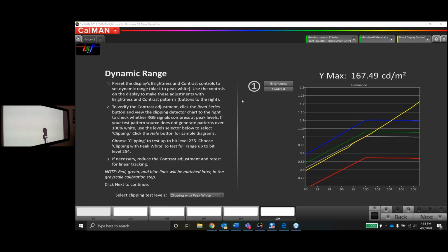And it goes the other way too. The bigger the screen, it doesn't have to be as bright to be as impactful, if that makes any sense. If we did 50 foot Lamberts on a 50 foot screen, it would probably hurt to watch. But good call. Yep, you're right. At least on SDR, it's 14 foot Lamberts.